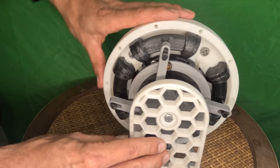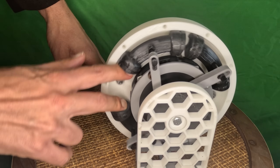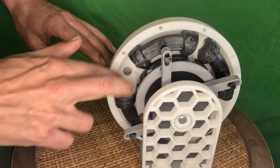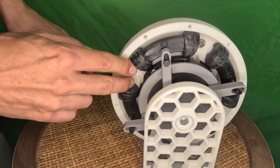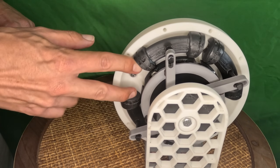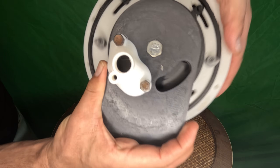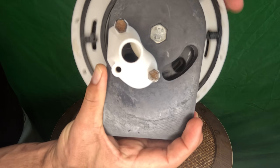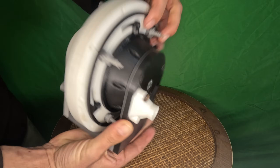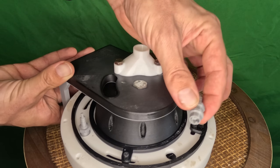A lot of people didn't understand how the explosion will happen, and I'll be pushing on both sides of the piston. Because of mechanical advantage, when I push my fingers apart it tries to rotate in the direction I want it to. As soon as you pass top dead center, the leading piston has a mechanical advantage over the other piston, so it will always move in this direction no matter how much force is on both. On the back side you can see the slots in the housing that's going to create the drive, and the ports for intaking fuel and dumping exhaust. The spark plugs will move with the cylinder, and power will just be transferred sort of like a distributor does.